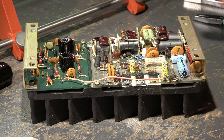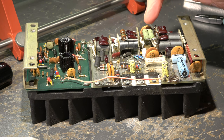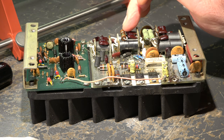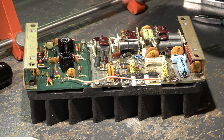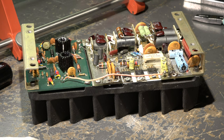The whole brick is ready now. All transistors are installed with thermal compound. For the power transistors we have the new damping resistors: 150 ohms, two times in parallel. This damping resistor here I checked — it has 15 ohms, not 150. It has 15 ohms; that's still okay. It's a damping resistor for the driver transistors. Now I will do another check whether it is stable or not before I bring it back into the transceiver.